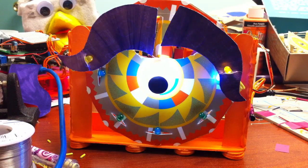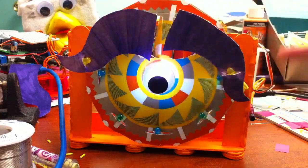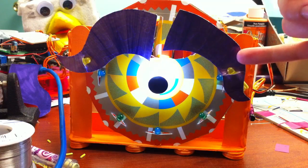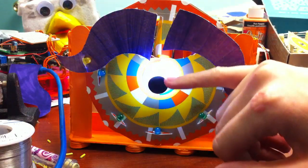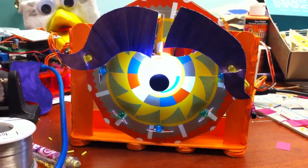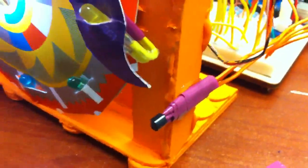So what it's all made out of is that it has some LEDs for its mouth — three blue ones and two green ones — and then two LEDs on its eyebrows, and then a white LED inside of here, and then an RGB LED inside of its eye. And then for the sensors, as you saw, it's three light sensors along the top, just light-dependent resistors. There's also a TMP-36 sensor, but I don't know what I want to do with it just yet.